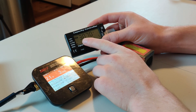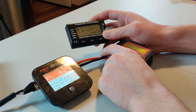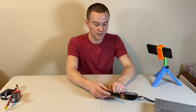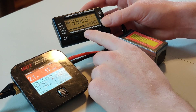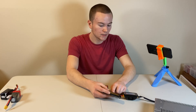Once it gets up to about 3.3 to 3.5 volts, I can stop the lead acid charging and just balance it like a normal battery. It's important to keep an eye on all the cells of your battery when you're doing this to make sure that none of them are going above 4.2 volts, since this can be very damaging to a lipo cell and can even result in a fire. Thankfully, all my other cells are only up at 3.9, though I'm going to have to keep an eye on this to make sure it doesn't go too high.